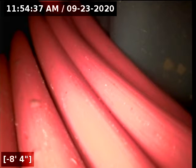Anyway, that section of the line is functioning and it is draining slower than it should through 26 to 36 feet, which is why I recommend the spot repair. Depth-wise, I was getting around 2.5, 3 feet deep in that section. But if you do any repairs there, you're going to have to relocate, because I can't leave permanent markings down on this surface out here. Now we're going to move over to the other 2 cleanouts.